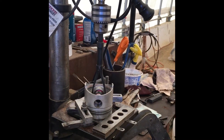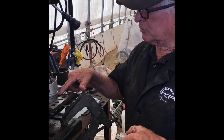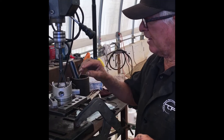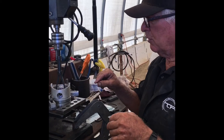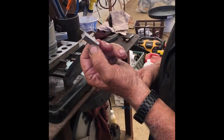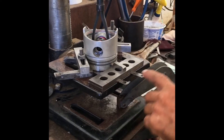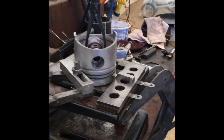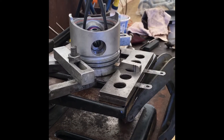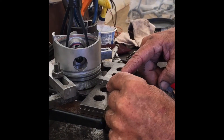In machining this, we have to determine where this groove is located and this table acts as a stop so the piston can't go anywhere. We already got that stabilized, so what we need to do now is locate our tool — this is our tool right here that we're going to use to cut our groove. I've shimmed this accordingly because I determined what I needed to do and how much I need to take out. I need to remove five thousandths out of this groove. So that's going to be the cutting tool.